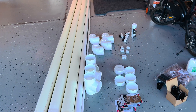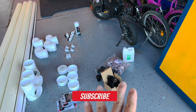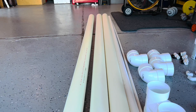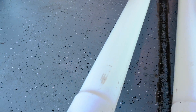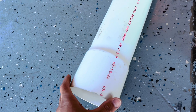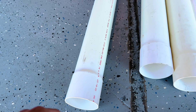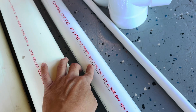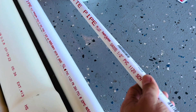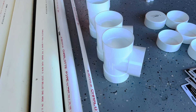These are the materials required for the build. These equipment are for the build itself, and these are for the growing medium. For the actual build you're going to need three of these 10-foot 4-inch PVC pipes. My local hardware store has this type of PVC where the very end is enlarged, so I'll have to cut that off. You need a 2-inch 10-foot PVC schedule 40, and also a half-inch 10-foot schedule 40 PVC.